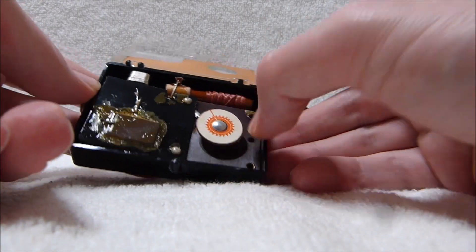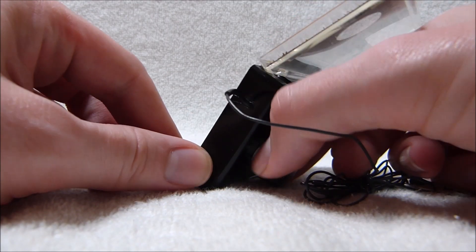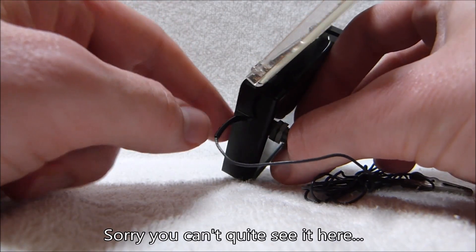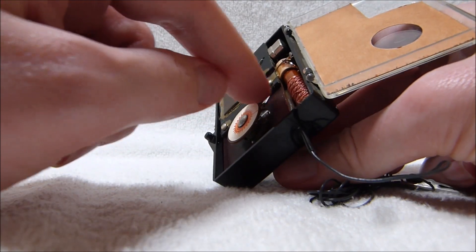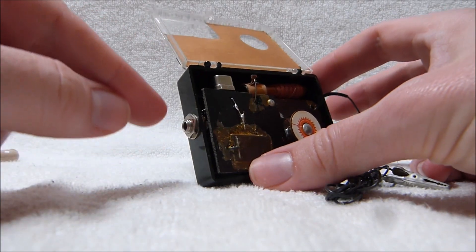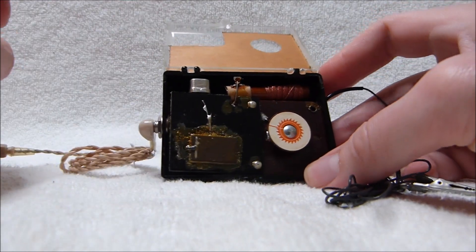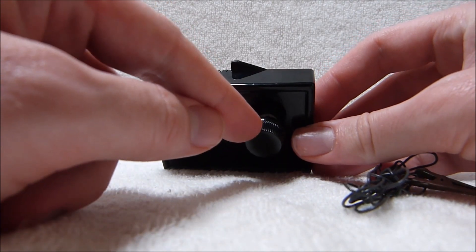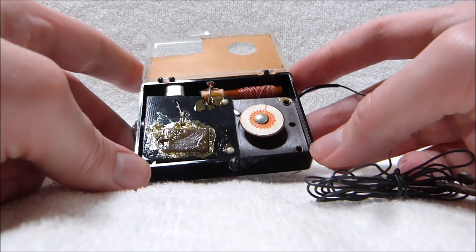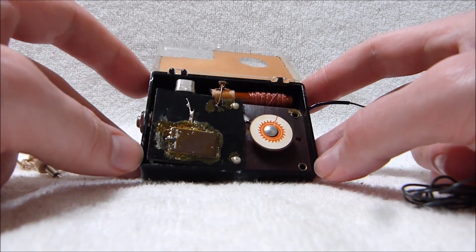This big brown phenolic piece here is the tuning capacitor. It's a fairly primitive looking one for 1957. The center contact is connected by a wire which is coiled around the underside of the little tuning dial and soldered there. It doesn't have the usual sliding contact. To take the radio apart, you just unscrew the nut holding on the earphone jack, then remove the knob by taking out its little set screw and undo that nut on the back. I've already taken this thing apart and taken pictures of the other side, so I'll just add that picture into this video.